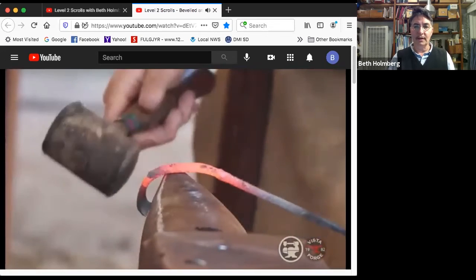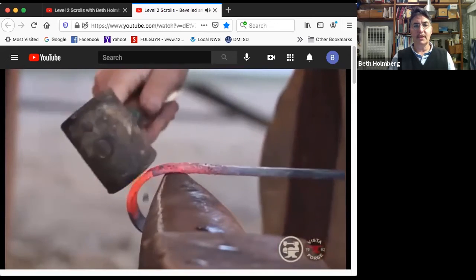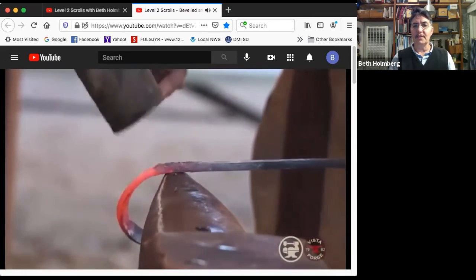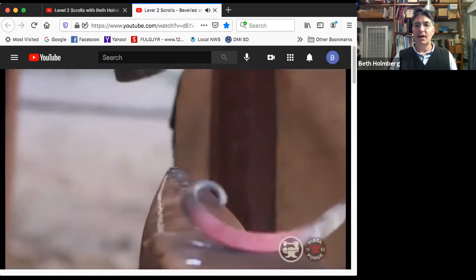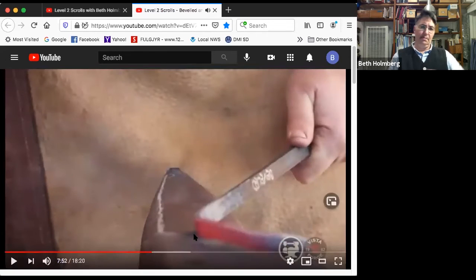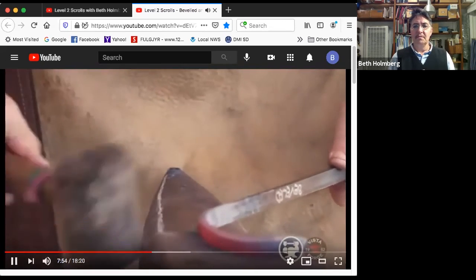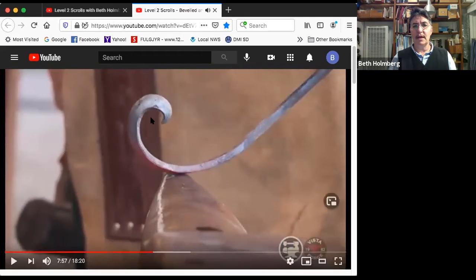It can't get folded. So tighter at the beginning, making sure it's all square, perfectly square. I'm really working on that perpendicular thing as I feed along here. I just noticed a funky little thing. No, I can't fix it that way. I couldn't fix it the other way because there's the little bend I've got in the metal. I've got to lay it on the anvil so I've got daylight underneath it, right? Beat the daylight out of it. So this is just going to straighten this little section out. There we go. So that looks pretty nice.